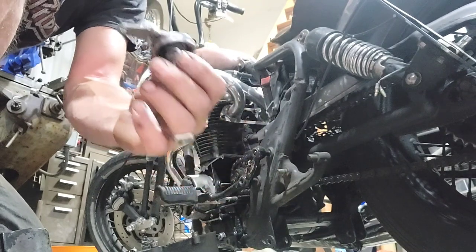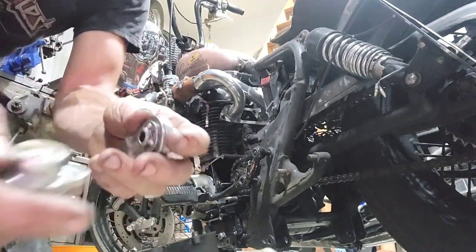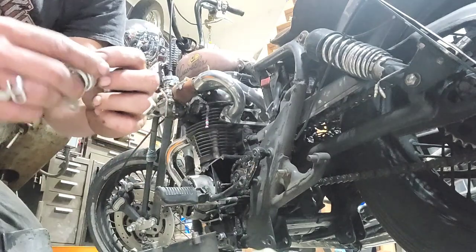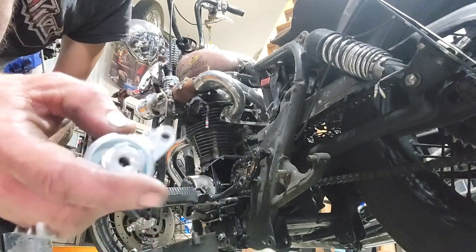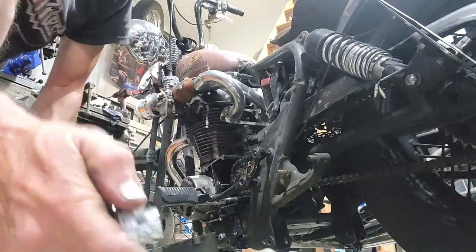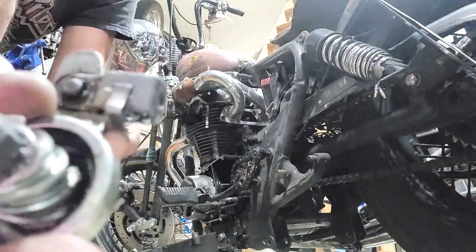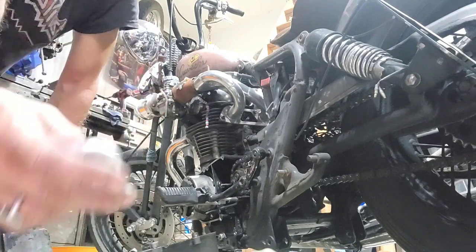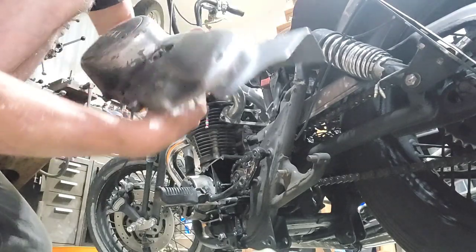This is the extra one I got. I did a couple things: number one, I initially took the threads out of it. The originals have threads in that center hole — M8, eight millimeter, 1.25 thread pitch. Those are fine and dandy for the stock setup because they're threaded for that little Phillips head bolt that screws in there. My idea was to make this longer so that it sticks out of the housing.